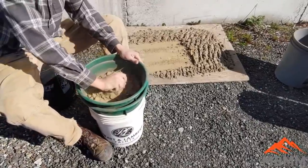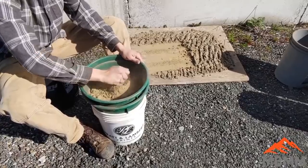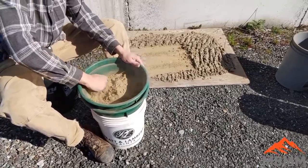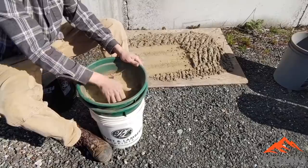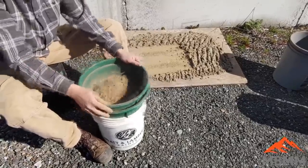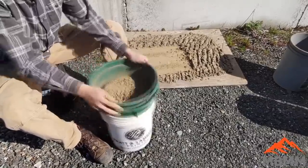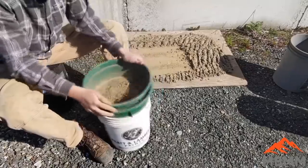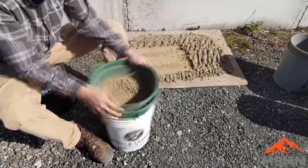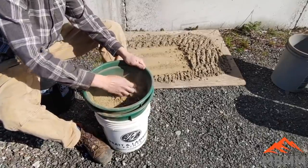This will be another good test to figure out the grind size from the hammer mill. And like you may have seen in the video, when I was taking samples, I took them right out of the number four port on the shaker table. I didn't take them out of the spiral. And so this has all the fractions that the hammer mill grinds to. It hasn't been classified or augered out or dewatered yet.